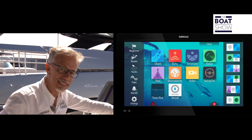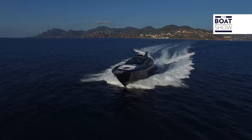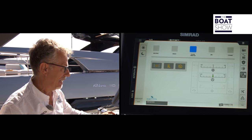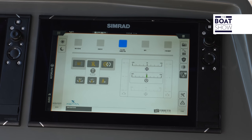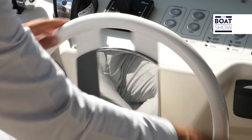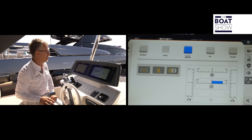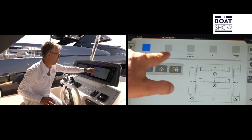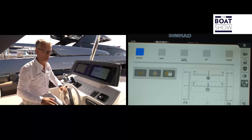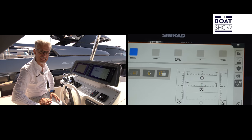But there is much more to this Naviop system. I can control the rudder and the joystick from this screen — this is the VDO. From here I can change how the joystick works, whether to moor up or cruise. Or I can add dynamic positioning to stay still in one place with the prow fixed in a certain direction.